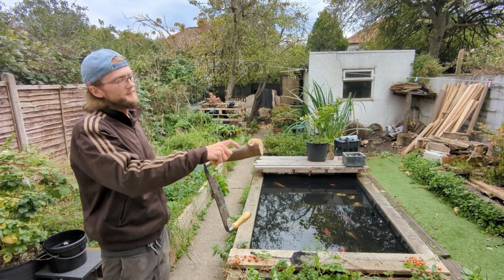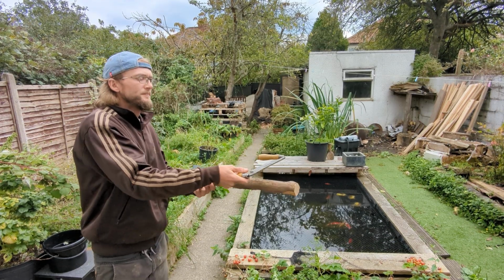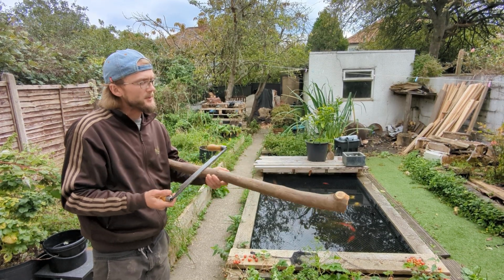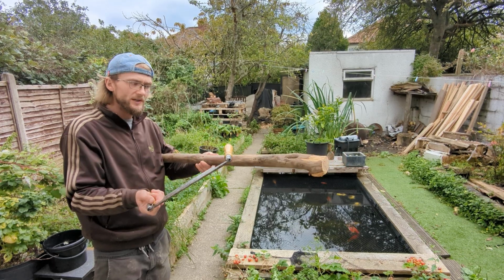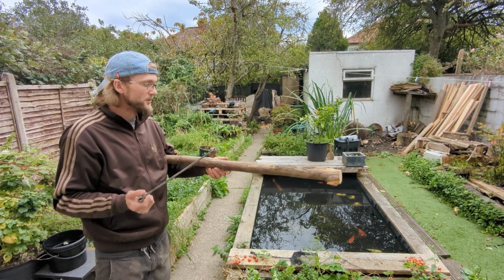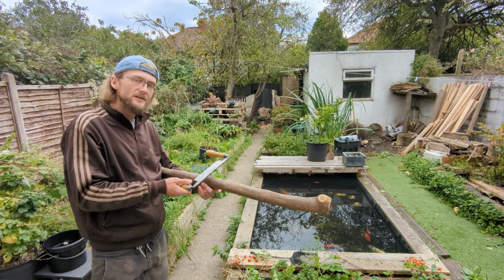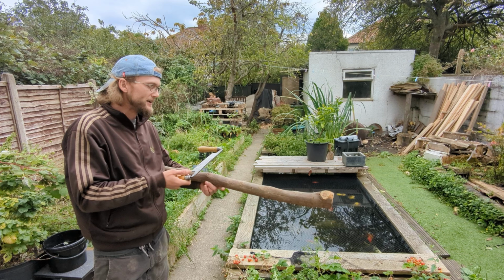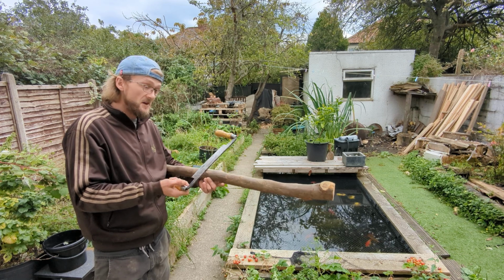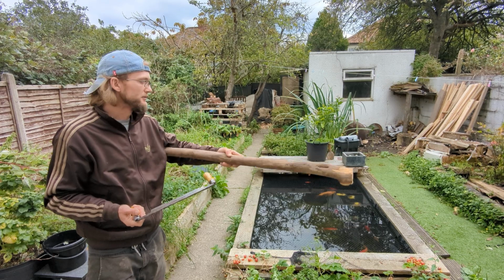So yeah, cut that through there. In case of taking your draw knife, running them down, getting rid of that bark, thinning it down gently, slowly but surely, being mindful of the knots, just like you would with a bow. Just be careful, because your knife's going to want to stop in your knots. It hasn't got even grains running through there. The knife might hit it and rip a knot out, which could write your stick off.